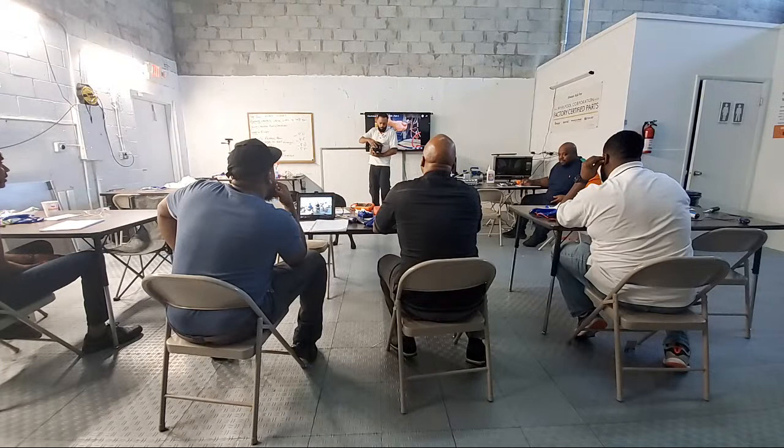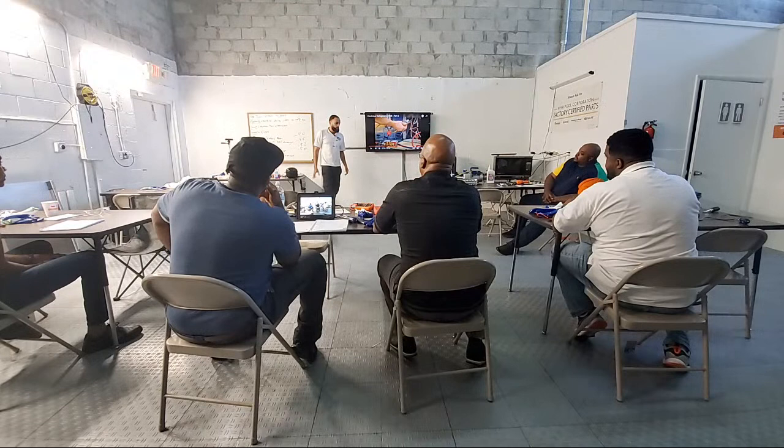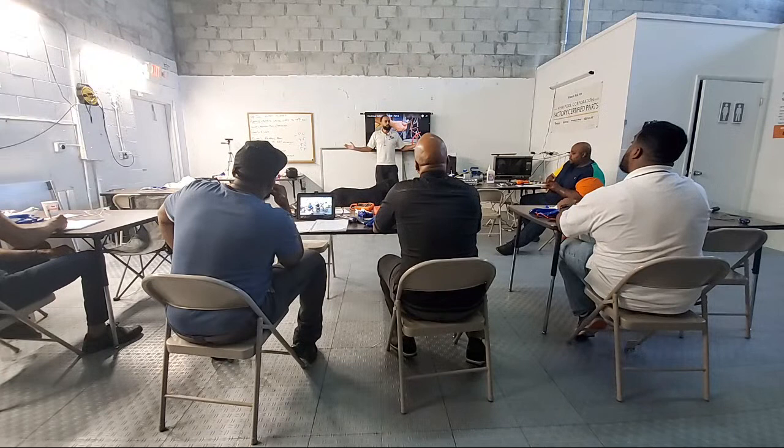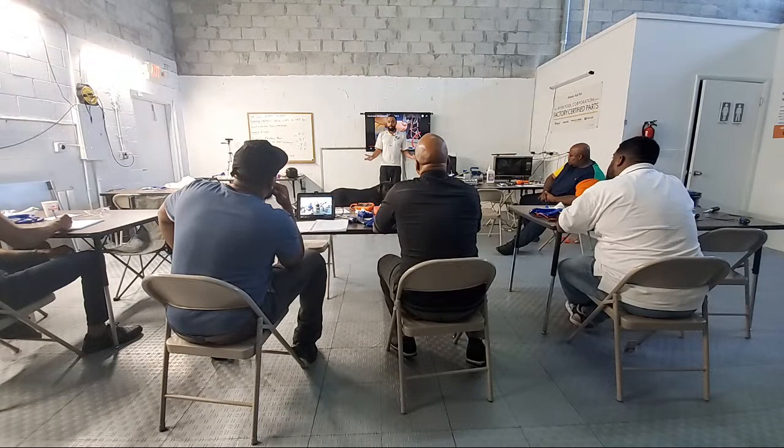There's a suction and a discharge. How can you tell which one is which? If it's your high side, will the line be smaller or bigger? Smaller. Does anybody disagree with him? Write that down, Peter. Guys, this is important stuff. I can't emphasize this enough. What's the wider one? We said was your suction.